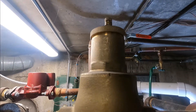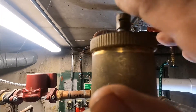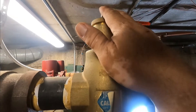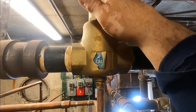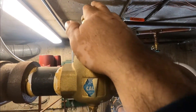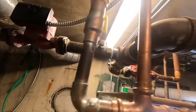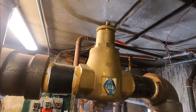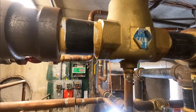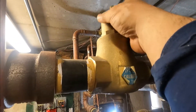I just turned the water back on and the air separator is working — can you hear? It is removing all the air, which is awesome. I have this valve off and now it has stopped. It was the air that was trapped in the main supply pipe all the way to the valve — and it just stopped, so that is good.